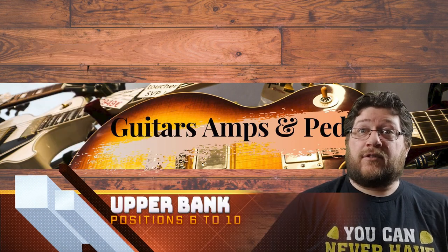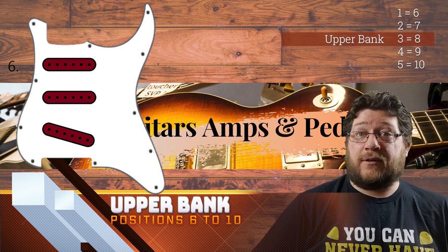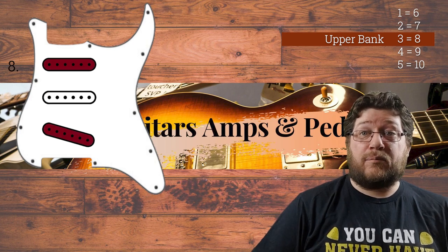It's the upper bank that gives us the series and parallel combinations, with position 1 giving us the neck, middle and bridge in series, position 2 giving us the neck, middle and bridge again, but this time parallel, position 3 is the neck and bridge in series, position 4 is the neck and bridge in parallel, and position 5 is the neck and middle in series.